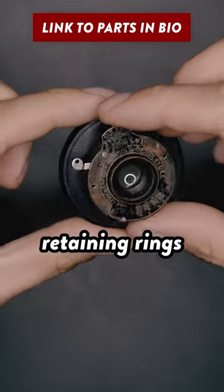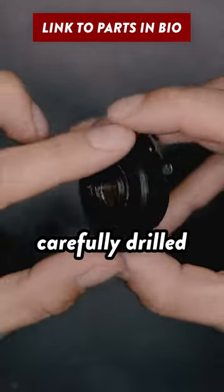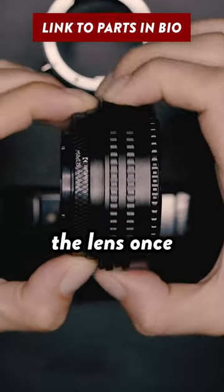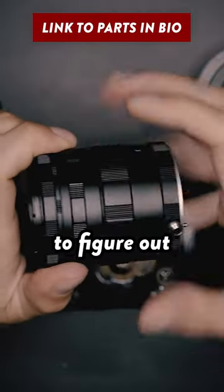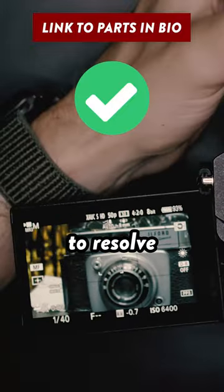Using the original retaining rings, I mounted the lens to an M42 screw-on body cap which I had carefully drilled a hole through. I then screwed this onto a helicoid — basically a metal tube that allows you to focus the lens once it's attached. Finally, I attached this helicoid to some macro extension tubes and used a bit of trial and error to figure out how far the lens actually needed to sit away from my camera in order for it to resolve a sharp image.